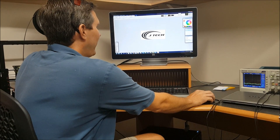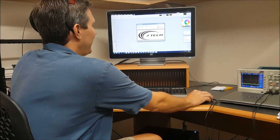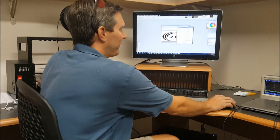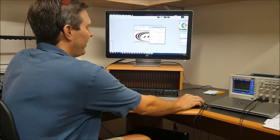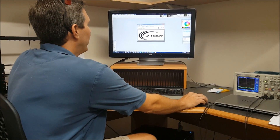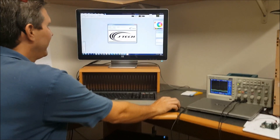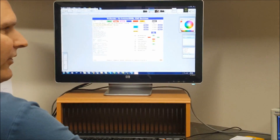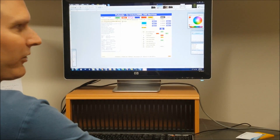We're going to take that and load that image into our laser etch software. The settings we're going to use — it goes really fast — so we're going to use 4,000 millimeters per minute for our on and off, because that's how fast our machine goes. We're going to use the M03S255 command for the Shapeoko. We're going to export that into a file and then load it into our PicSender program. You can use the Universal G-Code Sender, but we like using PicSender because it works really well.